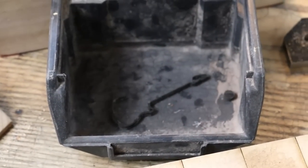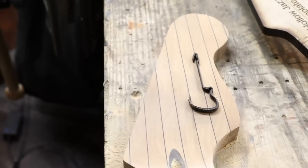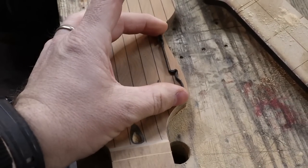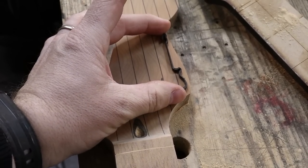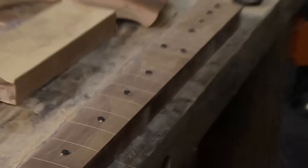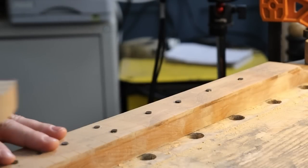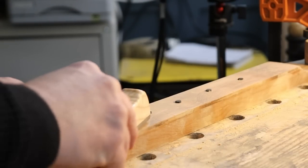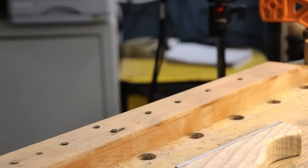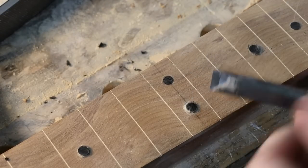The glue has done its thing - it's dried, it's cured, it's all sorted. This gorgeous little delicate piece of bog oak which I'm hoping I don't break. Maybe in line with one of the veneer lines - that could work quite cool. Ta-da! You can either start with a chisel or a file or a levelling beam or even a small plane. But I think a nice sharp little chisel, paring it down, is the right tool in this case.